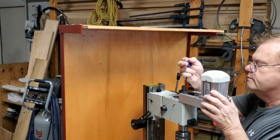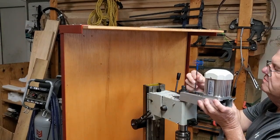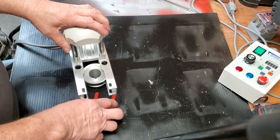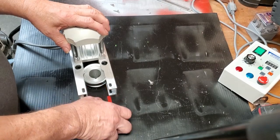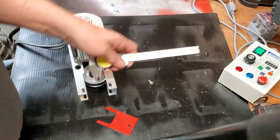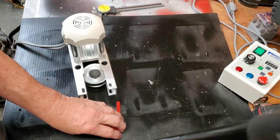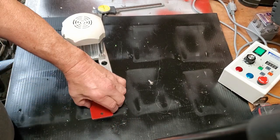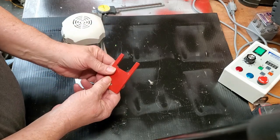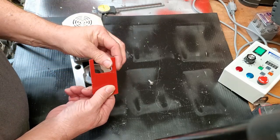Remove the bracket. Before you go any further, check to make sure your spindle lock fits. It does fit but it's a little tight. I got the caliper out, measured the screw holes here and on the milling machine — it's in the correct spot. What that means is this edge is too tight. When you put it all together, you're going to have to grind the edge off on your grinder so it goes in easy. There may be a slight difference in thickness from one side to the other — grind off the side that's a little thicker.